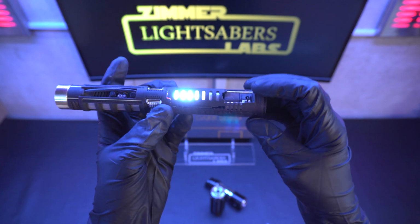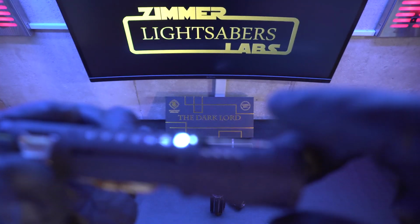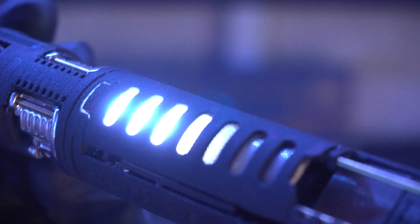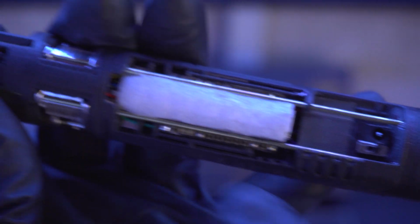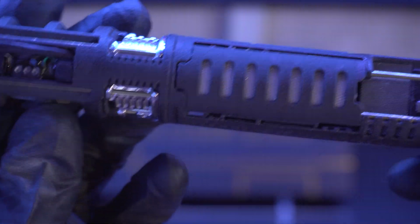There's a number of detail elements that you guys can probably see here. Some geometric mesh going on down here, also in the windows. Also behind these windows or vents, whatever you want to call them, with some diffusing material going on back there. And as you can see, obviously Neopixel accents going on. This is a cover. Just pop it off to get access to the soundboard. There's a strip of Neopixels here. Simply peel up and back to access your USB or SD card. Lay them flat back down and recap the electronics when you're finished. That way everything is nice and clean and not exposed.